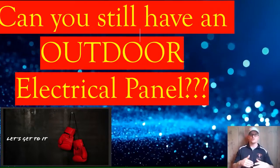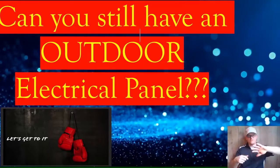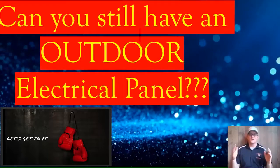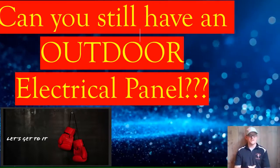What they do is design the panel so moisture doesn't get in and degrade it, and the panel covers are designed so when rain falls on it, it's not going to fall inside the panel and rot it out. If you were to put a regular indoor panel outdoors, it would rot out very quickly — if it didn't short out altogether.